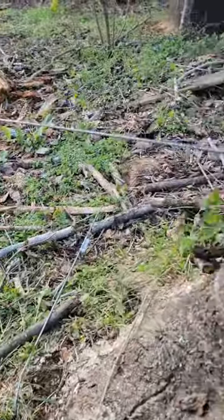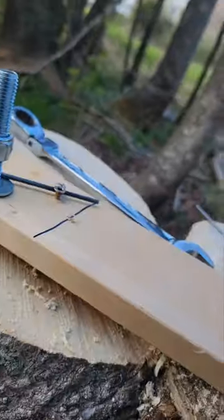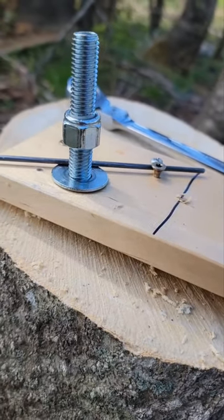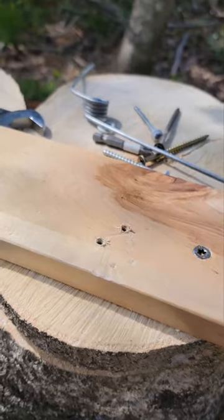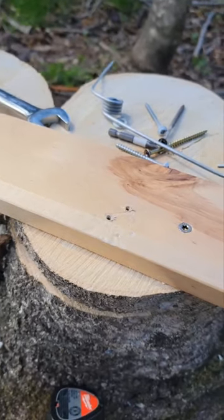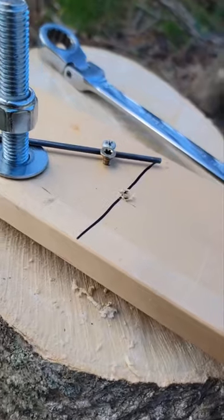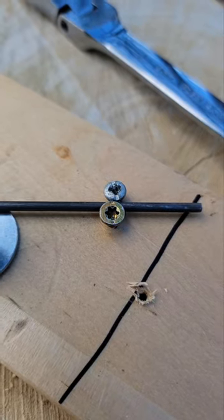I don't have a left-hand spring to go by, but basically it's just a mirror image. I've got my piano wire here and this is a half-inch board — a scrap board that I put a carriage bolt through the bottom. I tighten it up to pull it through into the wood. I don't have a vice, so I've got this screwed down to a double stump I cut the other day. I've got two screws in this board holding it down, and two more screws to hold the wire so it doesn't move around too much.